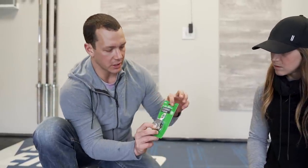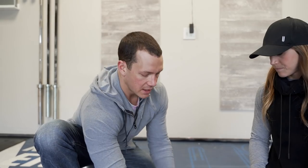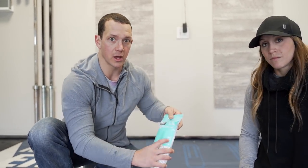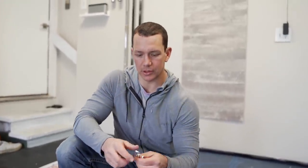My actual pulley here will hold 420. And our little manila rope here is rated for up to 124. So for what we're doing, we're not gonna be lifting anything more than that, but pay attention when you are buying stuff. So I don't have many pieces, but what I'm gonna do is put together my top portion first, which is gonna be my pulley. I've got a little pulley, and this one actually swivels, which makes it pretty nice.